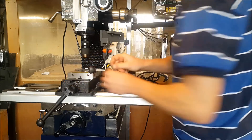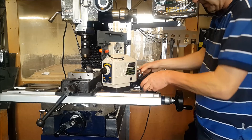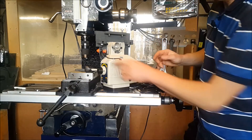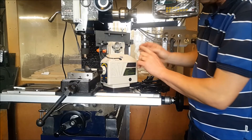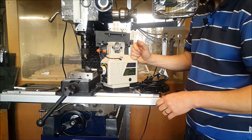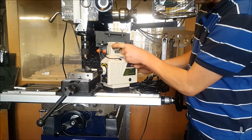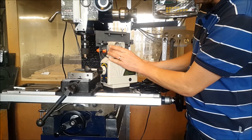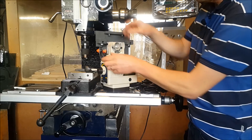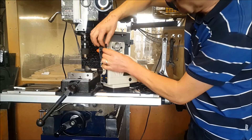I haven't nipped it up completely yet — we're just going to have a look and make sure we've got it in the right place, because the gear here has to match up to the other gear. We want that to be perfect because there's quite a lot of power in this and we don't want to be stripping the gear. We'll get it all squared up on the other tooth and then tighten it all up once it's ready to go.